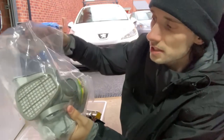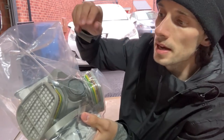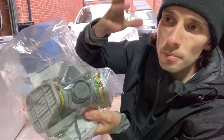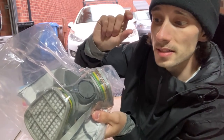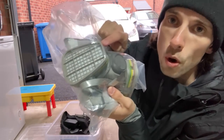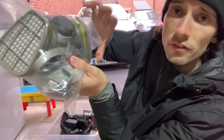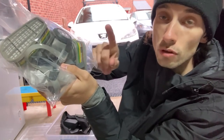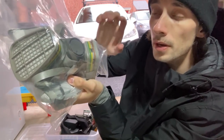Next up is a 3M half face mask — brand new, still sealed. I do recommend getting a full face one but I haven't found one that doesn't steam up, so I use a half face mask with safety glasses. The filters are ABEK1 filters — very important if you're using biocide. Look out for the yellow and green ones. If you're using just dust filters you're still ingesting the chemical — that's a mistake I made for a while.